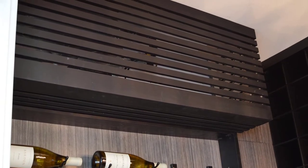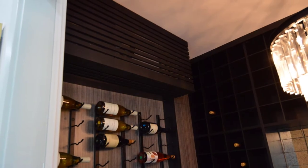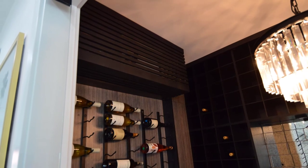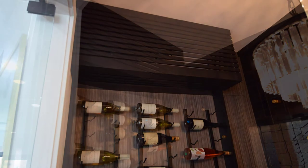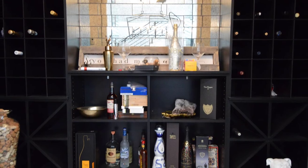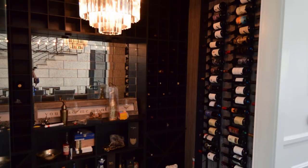Up here inside this concealed space is a commercial unit — it's not real beautiful, but it is the hardest-working and best unit in the industry that I can buy. It's louvered with three-eighths-inch gaps between each piece of wood, allowing it to breathe properly. Inside there's also a pump that catches the condensate water and pumps it to an outdoor location. You can hear it's not too loud. Any mechanical system is going to have a little noise — you're moving air, so you'll have the sound of a fan inside your wine cellar; that's just something you'll have to live with.